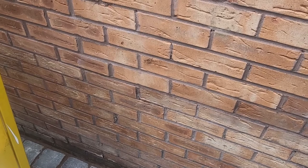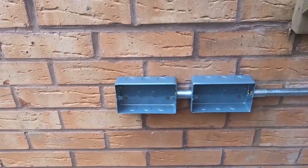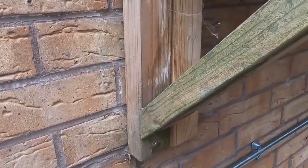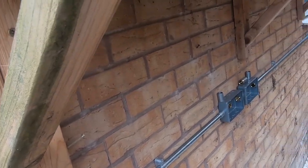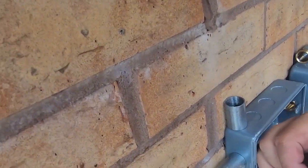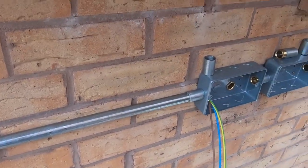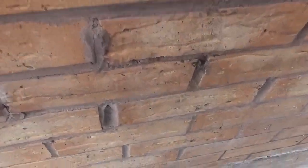So we'll just tape these together. These are 2.5 6491Y single cables, and we'll just push them through so that they can go down to that socket position. We should see that pop out at the end. There you go. So we'll pull enough to get this into the house. So that's going to be that much. That should go through to the house lovely.